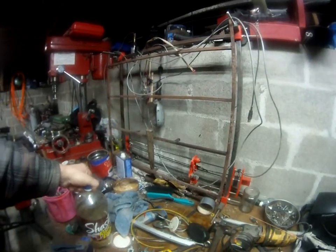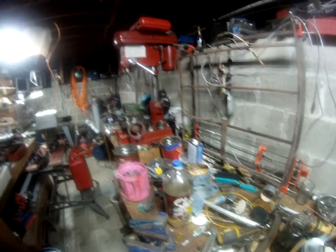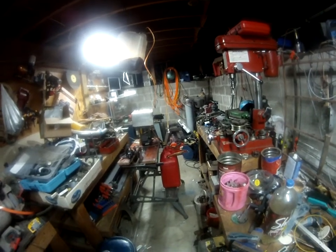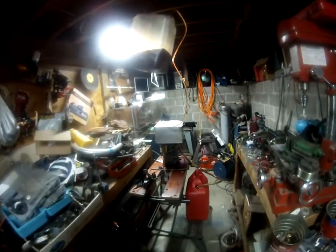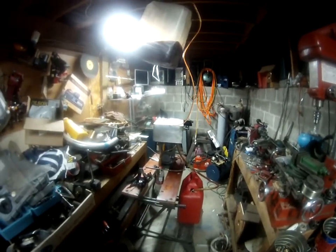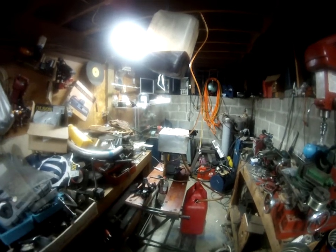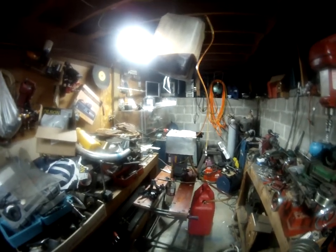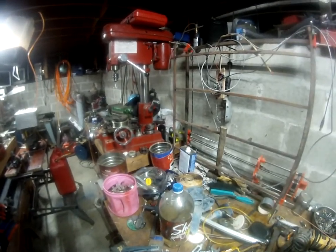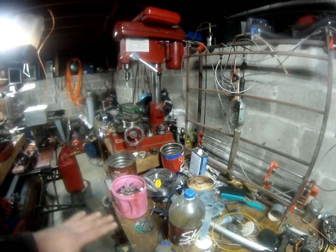And so that means the rest of the barrel should be pretty good diesel, but I'm still going to run it through the centrifuge. If I had sucked 40 gallons of water out and only had 10 gallons of diesel floating on top, I'd probably have gotten screwed. But just having 3/4 of a gallon, that's still probably not all that bad. And luckily, sitting so long, it settled.